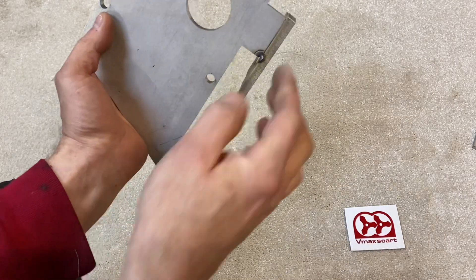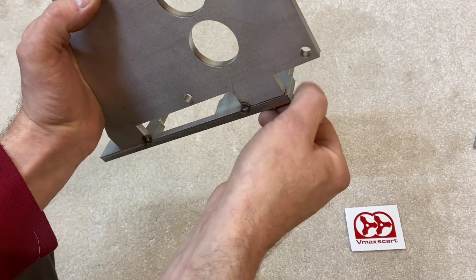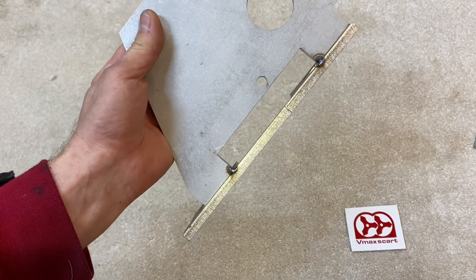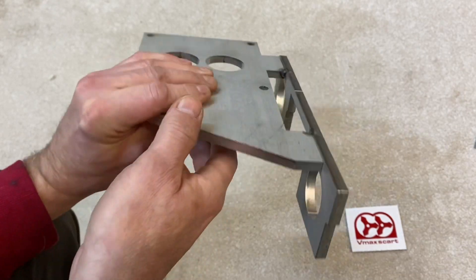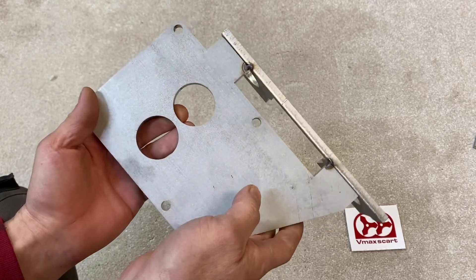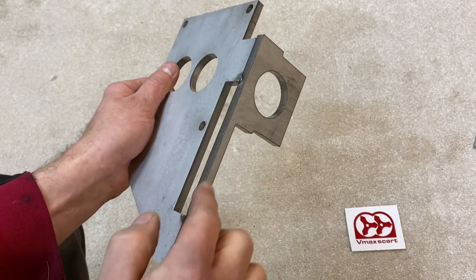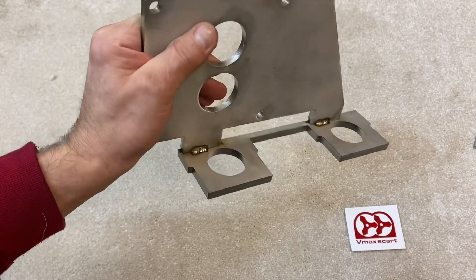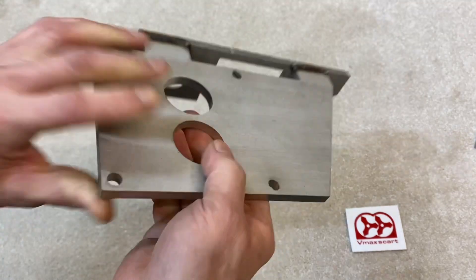This is tacked in place. What we can see here is a two millimeter step from the manifold plate to the inlet plate, two millimeters from being flush across here, and half a millimeter step down here. It's an 88 degree angle across here, not 90. Best thing to do is just tack in place and line things up, do a little bit at a time to stop heat distortion and any movement of plates as you're welding. This section will actually be removed afterwards to give clearance for the exhaust, but when welding it together it's good for keeping the distances correct and alignment.